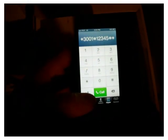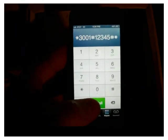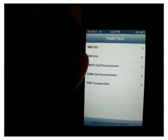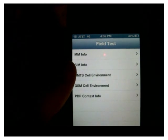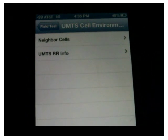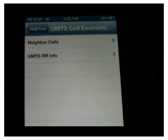For the next step I'm going to put my iPhone into field test mode by entering this code and pressing call. I actually get really good AT&T 4G service here, so for testing purposes I'll shield the signal a little bit by putting it in this metal box to cut down on signal getting to it. As you can see, our signal is about negative 81, which just jumped to negative 99 — that's our signal strength with no patch antenna connected.